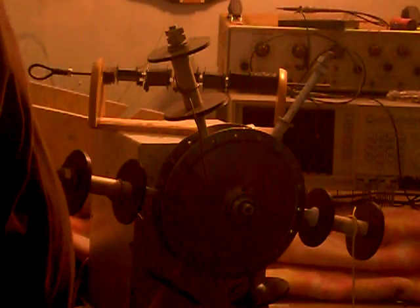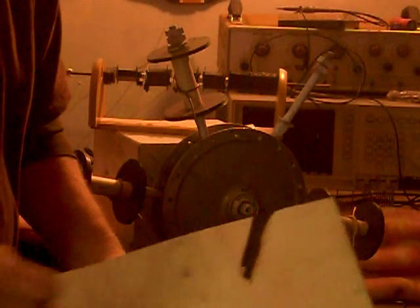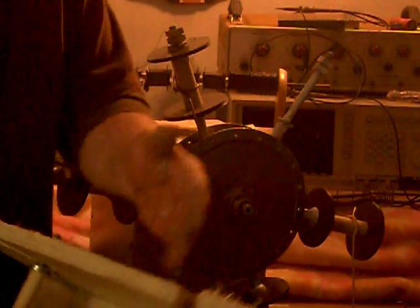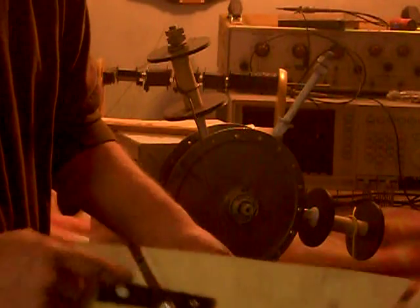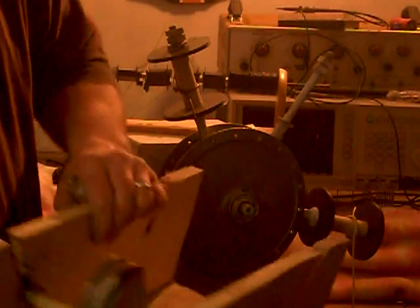I want to do a quick video on coil winders. This is an old chunk of wood out back — I just nailed these into a trough style with notches in it. You can see these notches right here, and then I have a little keeper on there too. It lets me make any size coil spool and go from one side to the other.